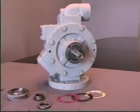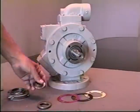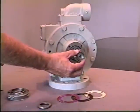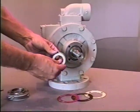Now we're ready to talk about installing the thrust bearing assembly. Again, if the pump is just being rebuilt, you would normally reinstall the same shims that came on each side. Just reinstall what came on the pump. If you're wanting to rebuild a pump or use new parts, it may be necessary to recheck the shims. The way that's done is by installing the thrust bearing assembly, starting with the mounting ring over the shaft, installing the thrust bearing along with the two thrust washers,